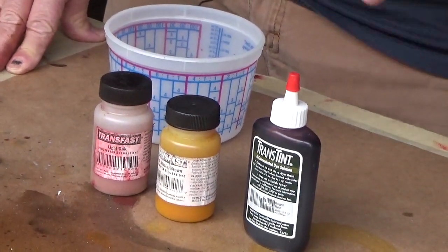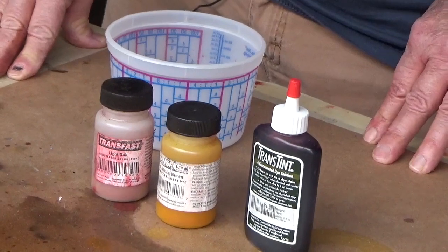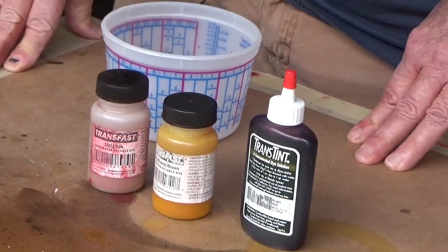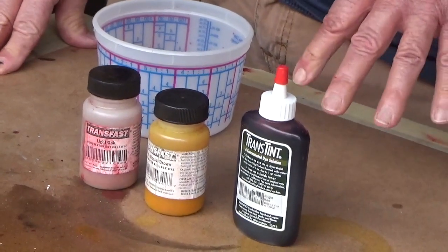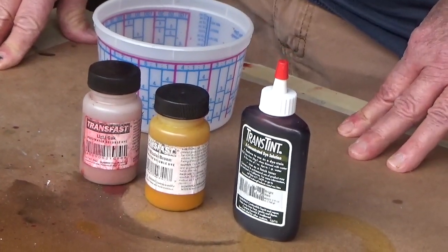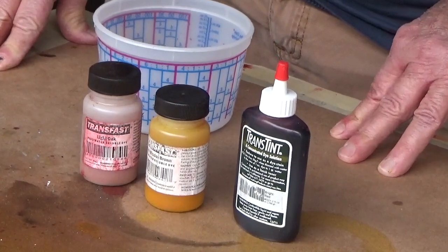You're going to see what the tone of the color is going to be, and we're going to make a little color adjustment after the water evaporates and we're ready to move on to our first clear coat, which is our quote-unquote sealer coat. We're going to use de-waxed clear shellac today.